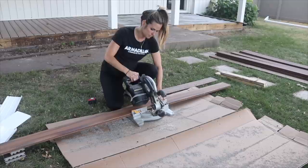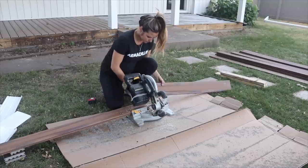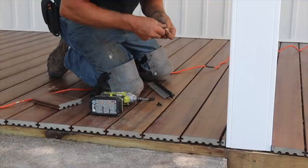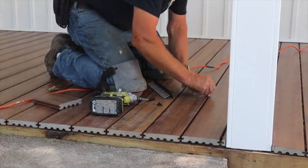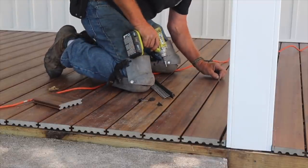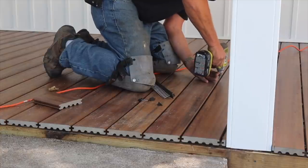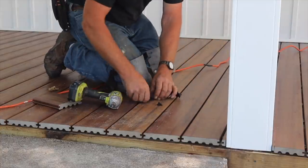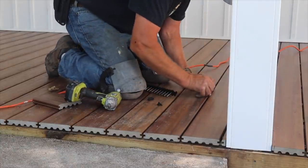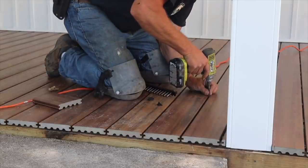Be sure to click that link — it'll be in the description and in the cards. But basically, this stuff is so easy to cut with a miter saw or a circular saw, and it connects together with this groove system and these very easy-to-use turbo clips, which have plastic grips, and then you screw the plastic clips down into your joist every 12 inches. Usually, you do that as you install each board. This clip is just showing John adding extra ones where we step onto the porch, and there's going to be a lot of heavy foot traffic.